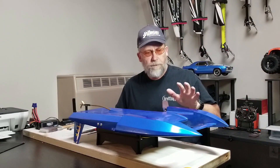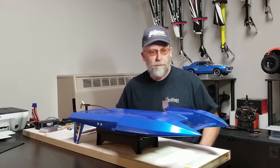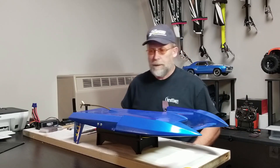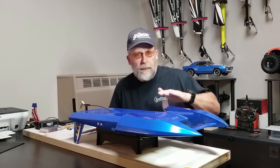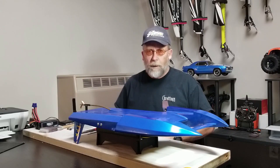Check them in the light here — pretty happy with how they turned out. They're flat enough I may not sand them after the paint cures, just pull the tape off. It's a little bit tacky, but you can get even flatter by sanding the paint — for that I would wet sand.